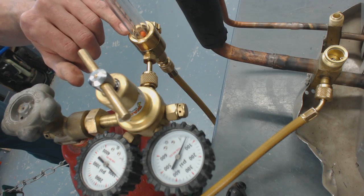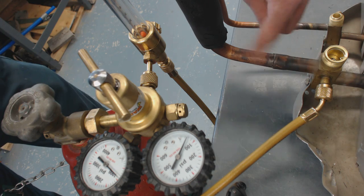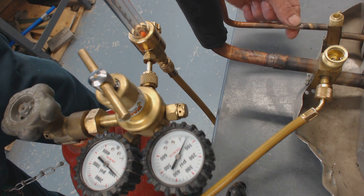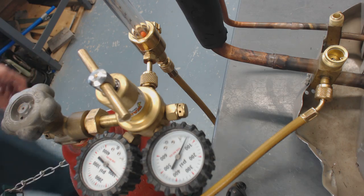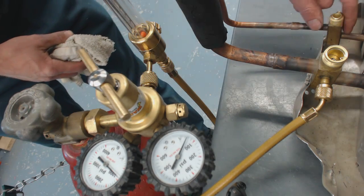It's going to hover at right around 3 PSI — below 5 PSI but above the inlet. So it's flowing up into the system, flowing back out, and right out here. We're going to be brazing this joint right here. Once we get to that point, we'll go ahead and put our wet rag on — we don't want the service valves to get overheated.